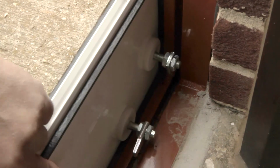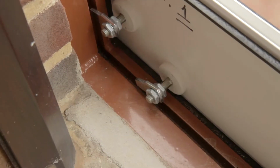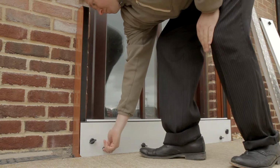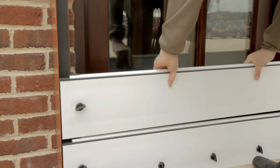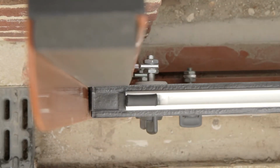Next, place the bottom board into position. Give all the compression locks a quarter clockwise turn to loosely locate the pawls into the frame slot. Add further boards into position in number order. Quarter turn the locks each end to loosely locate the pawls.